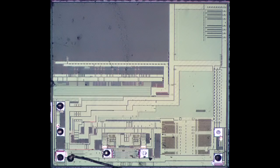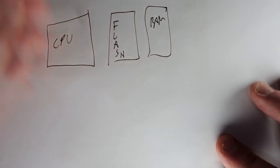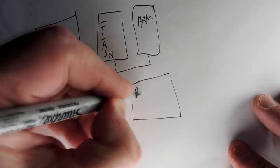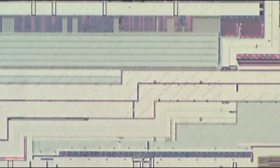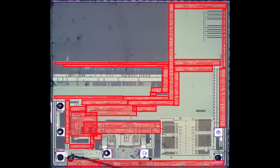Let's now take the microscope out and start looking at the integrated circuit in much closer detail. Here's the top level metal of the chip. Almost certainly this is a microcontroller — it's going to have a CPU section, a ROM section which holds the program and probably the secrets, a little scratch pad RAM, utility functions for power-on resets, clock distribution, and of course the wireless function as well. You really can't see very much because everything's coated with metal, and that makes the chip very hard to analyze. That's not a mistake — they've definitely done this for a very good reason: it makes it very hard to figure out what's going on in the chip, and that is your first step with security. We can see the bond pads for the bond wires that go off to the contacts or to the antenna, and the power distribution rails carrying power around the chip.